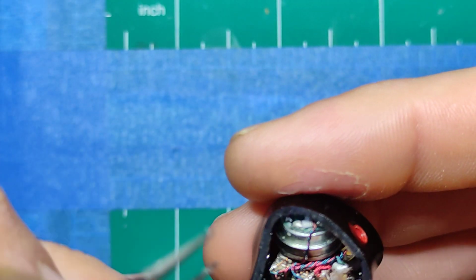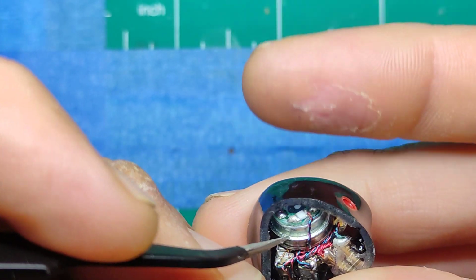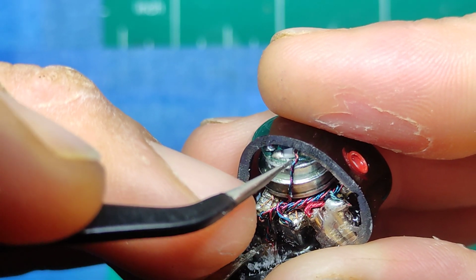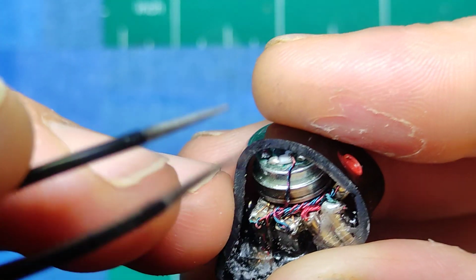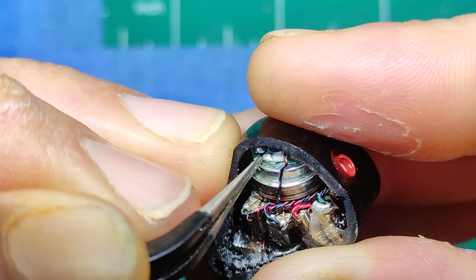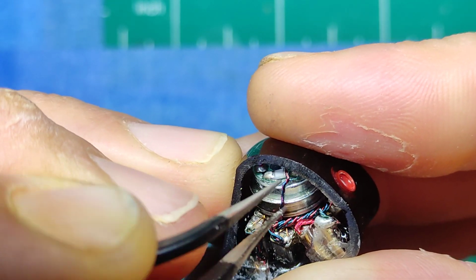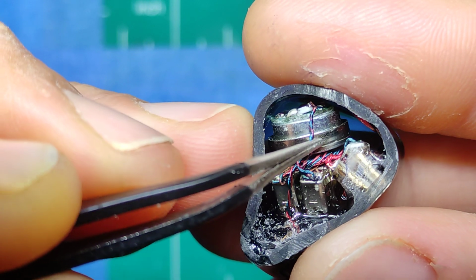With these, a couple other things, just little side notes. I don't know if you can see that. There is a resistor attached to the back of the driver. It's 0805. I don't ever recommend attaching them this way. Yeah, it's solid, it's not going to go anywhere. But if the person who built these was doing it on a Friday or something and the connection isn't very good, or these take a drop, this could easily snap off. And you can also see it's great because it's neat, and this is proper IEM manufacture.